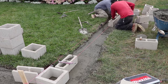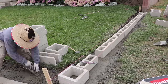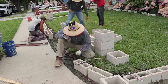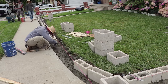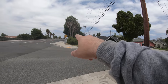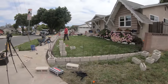This actually happens to be my son's job. They're going to put rebar — the verticals are going to be every 16 inches on center. Every block is going to have a piece of steel in it. Not every cell, but every other cell, so every block will have a vertical piece of rebar. The whole wall will be solid grouted to be a buffer. It's not going to stop a car but will slow it down. People do a lot of donuts at this intersection and sometimes they lose it coming out — they went through that house across the street once already.